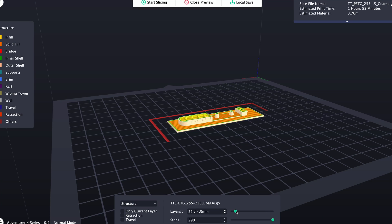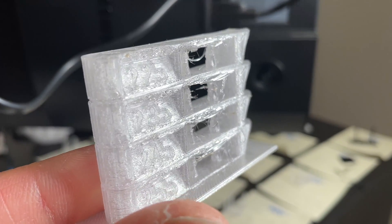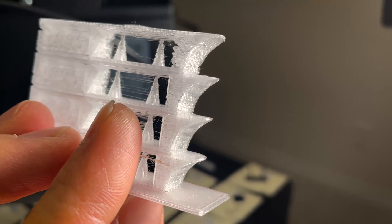When I bought my printer initially I wanted to print with different filaments, not just PLA. So I bought a clear roll of PETG from RepRap — links in the description below. With this clear filament, the first time I printed it I tried a temperature tower to figure out which temperatures worked best. When it printed out, it looked terrible. There was a lot of blobbing, stringing, and the part was extremely brittle with separating layer lines.